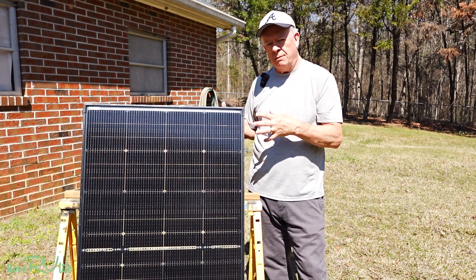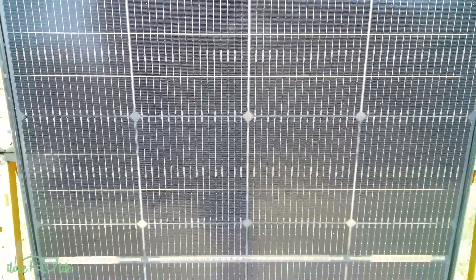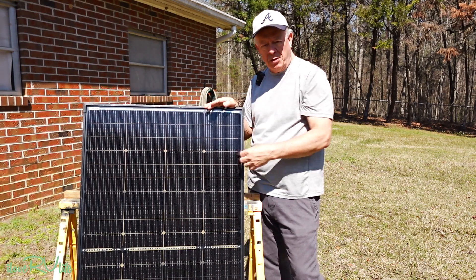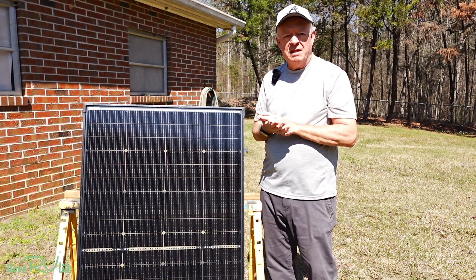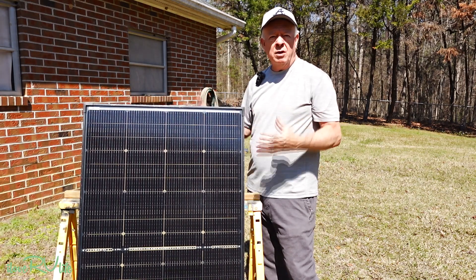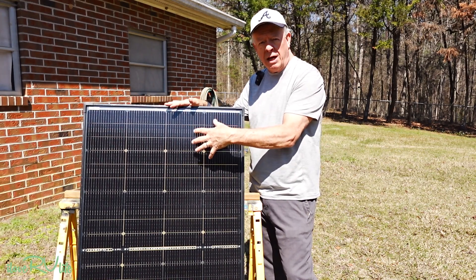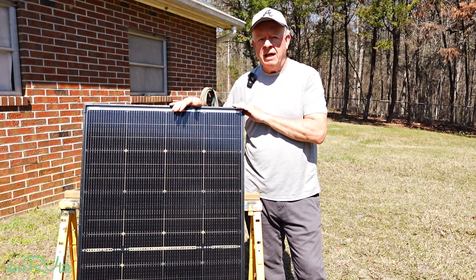Also about this N-type that's different from other solar panels: it has 16 bus bars. If you look at a closeup, you can almost see the individual cells and bus bars in this configuration. What this does is collect across all those individual cells and bus bars and conduct the electricity through the panel. That means higher efficiency, better performance, and less power loss. Inevitably when we mount these on RVs, they'll be close to an air conditioner. Some part of the day you may get shadowing on a corner. This panel will continue performing even with partial shading — with many non-N-type panels, that does not happen. We'll test that.